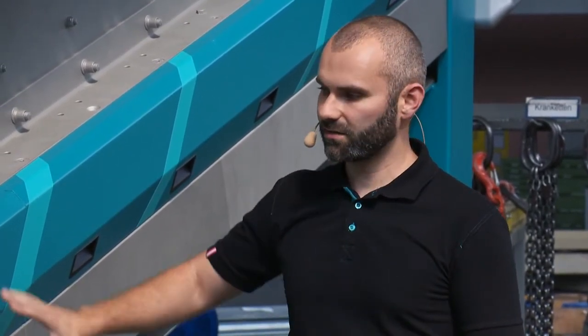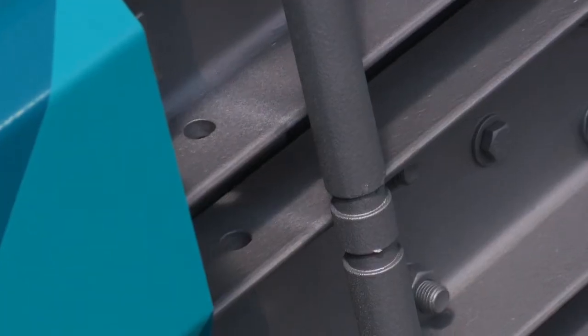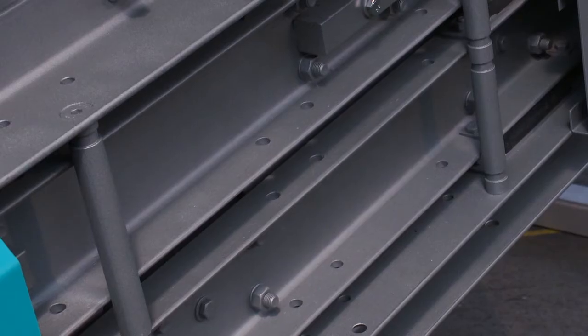The mass balancing of the two frames takes place within the screening machine itself. In conventional Resonance screening machines, two screen decks move counter to each other. In this new design, two screen frames holding the flexible screen mats move counter to each other. This gives the classic Bivitech whip effect.